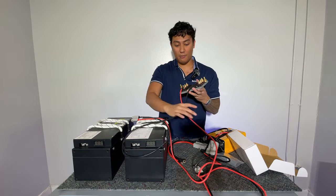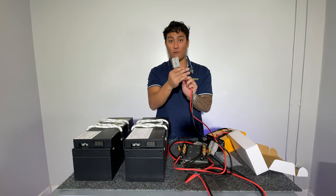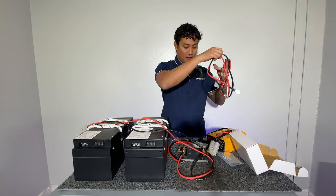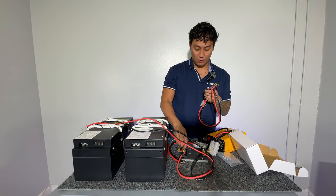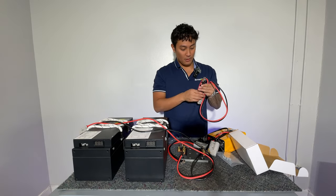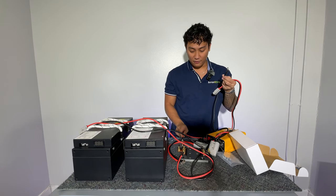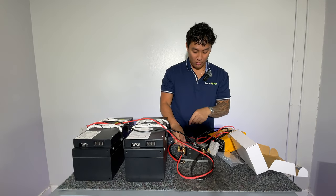You're going to do the same thing. We have this smaller universal wire, and this is for one battery pack. Next we're going to do the second wire for the second battery. If you have more than one battery you have to do two; if you have more than two you have to do three wires connected to the bus bar — same with four. Red is positive, black is negative. Attach positive to positive, negative to negative, and screw both of them on.